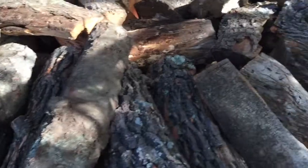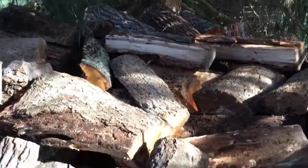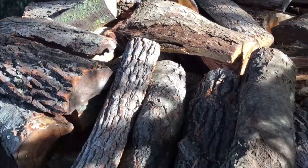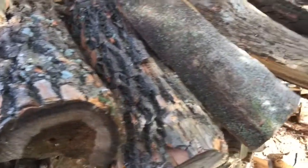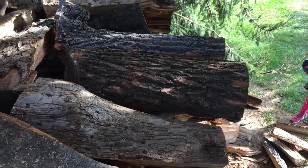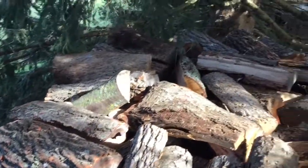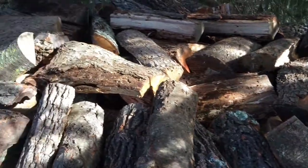I've got the first layer of the roof on. As you can see we're using half-round logs with the bark on. The bark side goes up on the edge around the sides. We overlap the logs a few inches and we have everything angled down out of the stack, instead of angled in as we did before. We've changed the angle of the logs and we're using basically only half rounds with bark on.